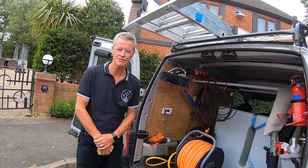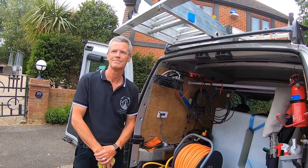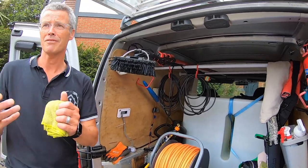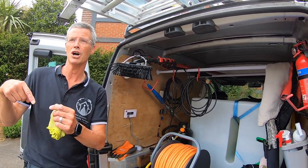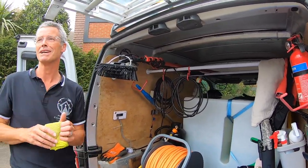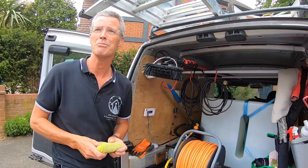So you've got an RO system at home and a thousand-litre tank - yes, a thousand litres, so you make the purified water there. I've just realised it isn't that efficient because my PSI at home is only about 30, so I'm looking at increasing my PSI to get more efficiency with the membranes.